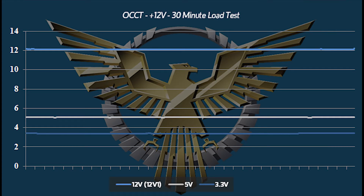Looking at the performance of the PowerZone 750, we see really nice, solid regulation and power delivery across all the rails — no large dips or big drops on any of the rails, just solid power delivery all the way through. It went through our 30-minute test through the heat without issue. The PowerZone 750 never really got loud — definitely not particularly audible in any way, shape, or form. The fan never really spun up, demonstrating good passive cooling along with the Silent Wings fan keeping things quiet. All in all, a very solid showing from the PowerZone 750.